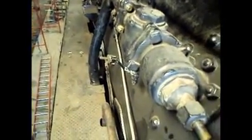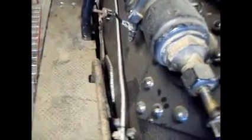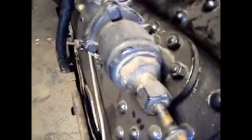But I'm going to climb down. I have to climb down this way because we haven't got the toe boards. They're outside actually. We haven't got the toe boards underneath the cab installed yet. Also, on the other side, the valve opening for the pipe, the check valve was open. That was leaking, and we thought that was it. But when we closed that, we found we had to seal up one of the connections on here. It was on the other side. Now this side was fine. It was on the fireman's side.